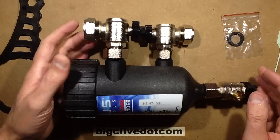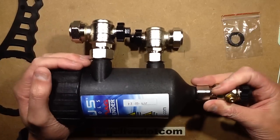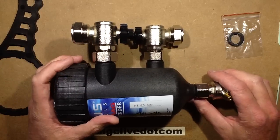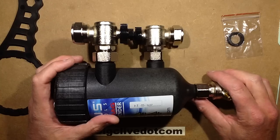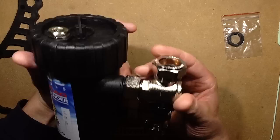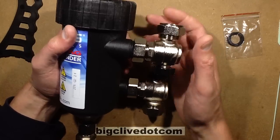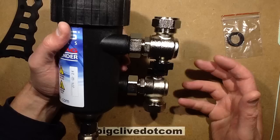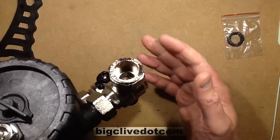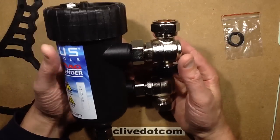Another random diversion on this channel. This is a magnetic sludge remover for heating systems, which I got for my heating system and will be installing on it. What these things do is intercept one of the main heating lines. In the UK, our standard copper pipe sizes are 22 millimeter and 15 millimeter — those are the sizes you'll find in your house. This device is designed to go on a 22 millimeter line, the main line of the heating system.